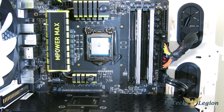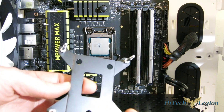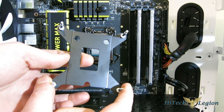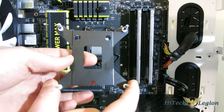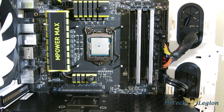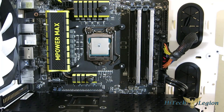Getting into the actual usage of the SecuFirm 2 — I've already gone ahead and applied the thermal interface material to the CPU. First, we're going to start with the backplate. As you see, two holes in the top, one notch in the bottom, which is going to correspond on an LGA 1150 series CPU mount on the back of the motherboard. Make sure you get the top two holes on top, and it's just going to slide into place with the four bolts going through. I've got four plastic spacers which are going to go on.